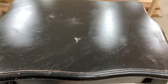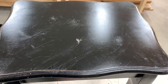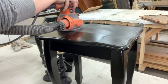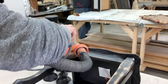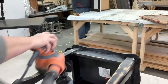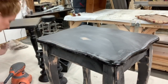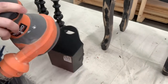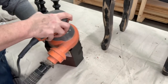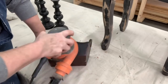There are probably two ways you could fix this gouge in the top — you could fill it in with some wood filler or spackle, or like what I chose to do: I'm just going to sand it smooth. MDF board with its shininess may not take the paint as well as I want, so I'm going to sand it smooth. And the same thing with this little box — it's all marred up, it's MDF board, so to get that shininess off so the paint takes well, I'm just going to give it a quick sand since I have the orbital sander out anyway.